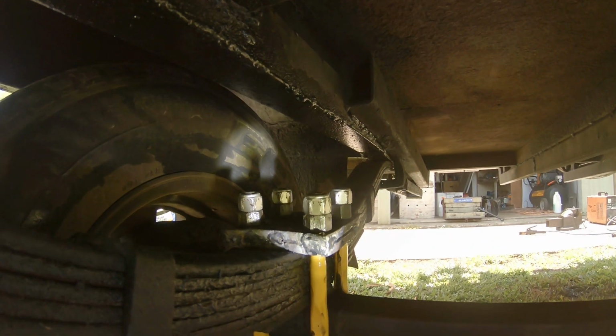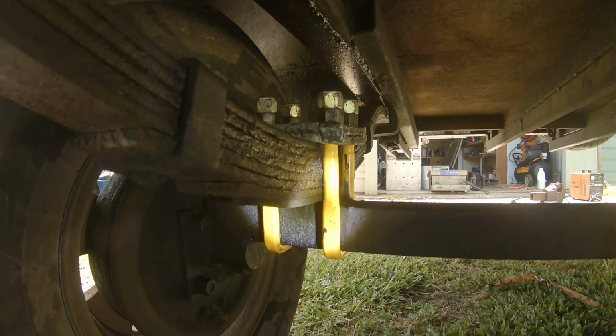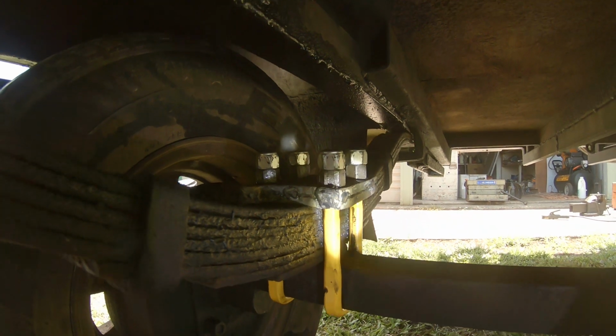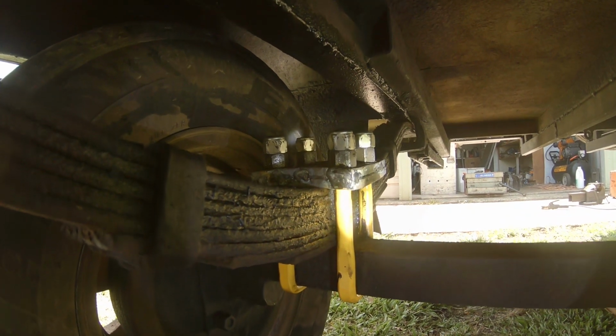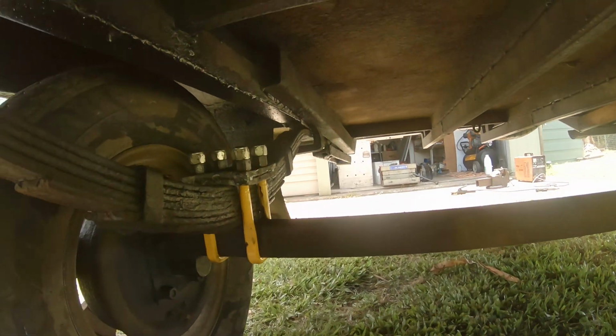Lock nut on top of the high tensile nut on that high tensile U-bolt. Gee, that looks good. Double thick plate. I welded 2 plates together so they don't bend. That's the biggest trouble, they bend, like I was saying there in the corners, and let the tensile go off them. That just did up and didn't move. I've got to do that one that side now.